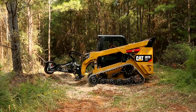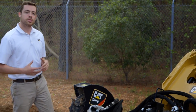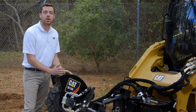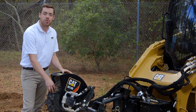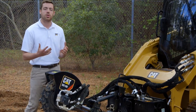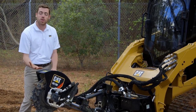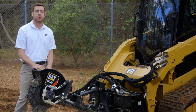It's very key in order to make sure that you can grind that stump very efficiently and safely. The CAT stump grinder family features a direct drive hydraulic motor — whether standard flow or high flow — which translates the energy from the machine in terms of oil into pure grinding torque. This grinding torque uses 32 carbide bits that are easily bolt-on for replacement, ensuring you can get through the hardest of material all the way down to soft woods, and grind them below ground level to easily maintain afterward with a garden tractor or lawnmower.